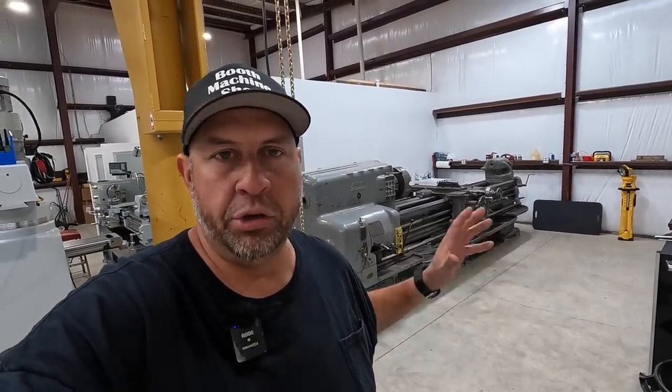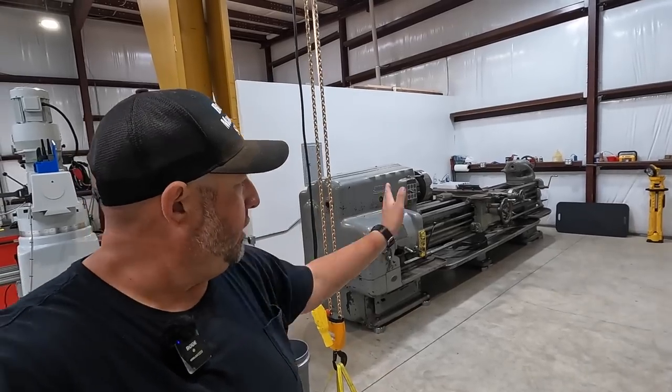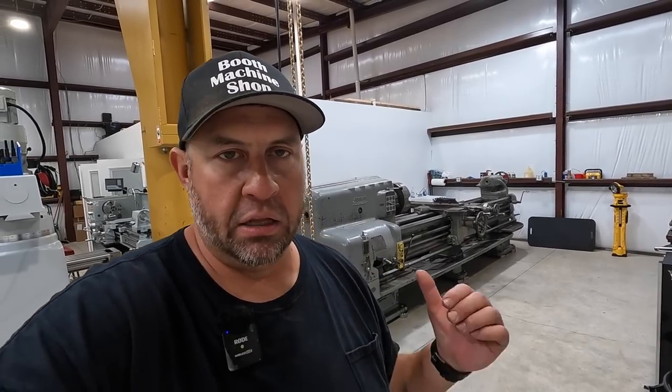All right, guys, I feel good about the work that we got accomplished on the American Pacemaker today. I feel really good about the level that we have it at. And after we do a little bit more work on it, I'm gonna go back, I'm gonna check it again and make sure it hasn't moved. And if it has, we'll tweak it if we need to. But I have checked both ends and the center, and we are about as level as I can see it with that precision level, which is super close. So that's great. All the leveling pads, screws, all that work turned out just fine. And it's all ready to go.